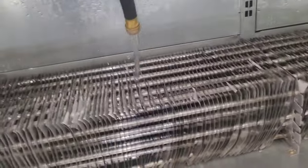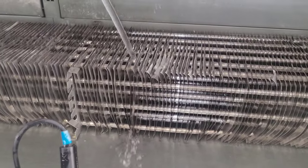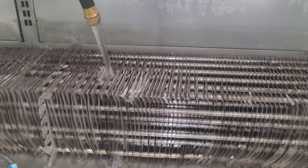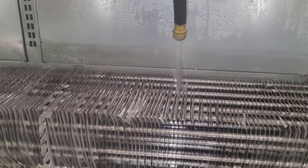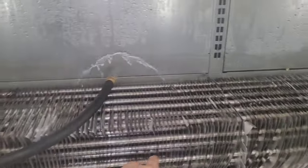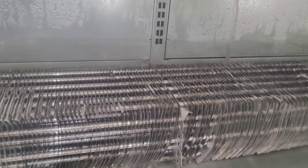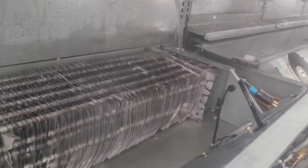If you get your coil washed this good, you can put it back together and start it up. I say it's okay, because you've got most of the ice out. But make sure that down there in the very middle core of it, you don't have a big ball of ice blocking it everywhere. Because if you do, you'll have to take this thing apart again and do this all over again in a couple days.